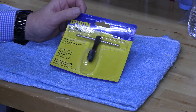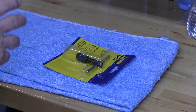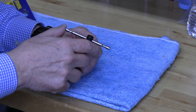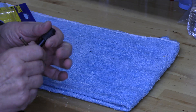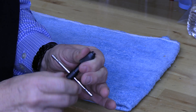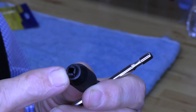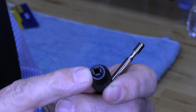This is the packaging it came in. I took the liberty to split the top open — we'll let it come out. When you look at it you're thinking that's kind of nice; it's got a sliding T-handle with ball bearing detents. But when you try to tighten this it is rough and gritty, it's hard to twist. And this is the smallest opening it can open to, which is not zero at all — it's smaller than a quarter of an inch certainly, but I've got a number of smaller taps that this will not work with.